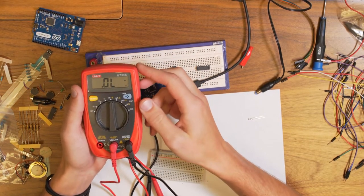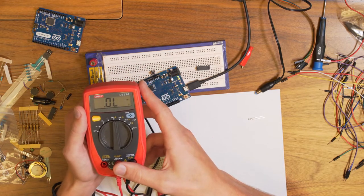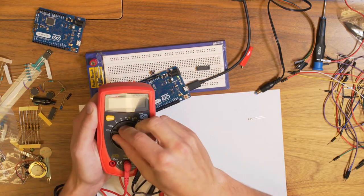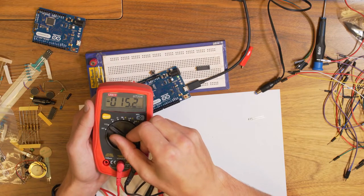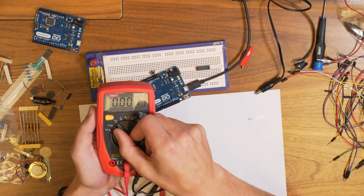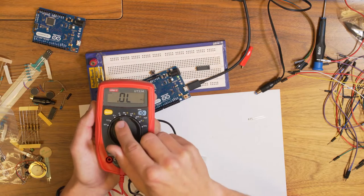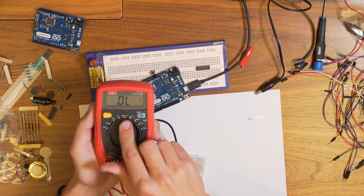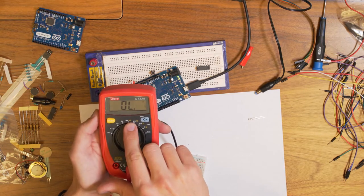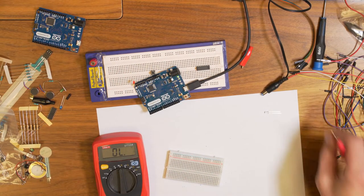Here we have a multimeter. I think some of you have a similar model in your kits. You can choose what you want to measure. So it's off. I'm measuring voltage, direct current, DC, or alternating current, AC. So DC, AC, resistance; you see the ohm sign there. And here you have this thing. It's a diode, or a yellow sign, and you can press this one, and it will make a beeping sound. Basically, I can use this one to check if a cable is working.